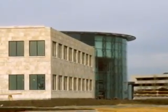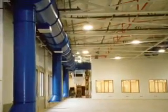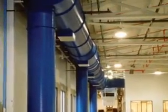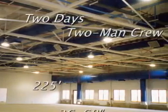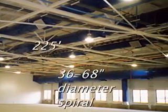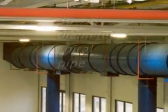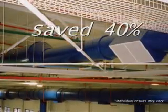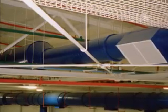The sheet metal contractor at Ingersoll International in Illinois utilized Easy Flange with Barrel Clamp. The job site foreman stated that the job was made easier with the system. In just two days, a two-man crew was able to hang 225 feet of 36 to 68 inch diameter spiral pipe with Easy Flange and Barrel Clamp. The system saved this company about 40% on field installation costs, especially when threading the large diameter spiral through the bar joist.